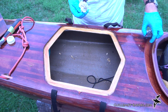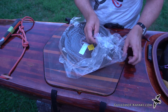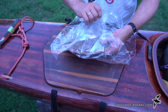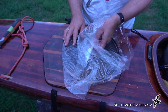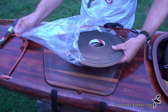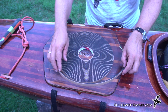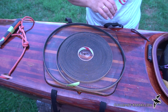That's pretty clean. Now I'll put a new gasket on. This is a weather stripping - it's a half-inch wide, 3/16ths thick, and it's got a soft cushion. It's a sort of closed-cell foam so the water doesn't get through it and it's easily compressible, so it doesn't take a lot of down pressure to get it to compress. I'm just going to measure out enough to get all the way around here.